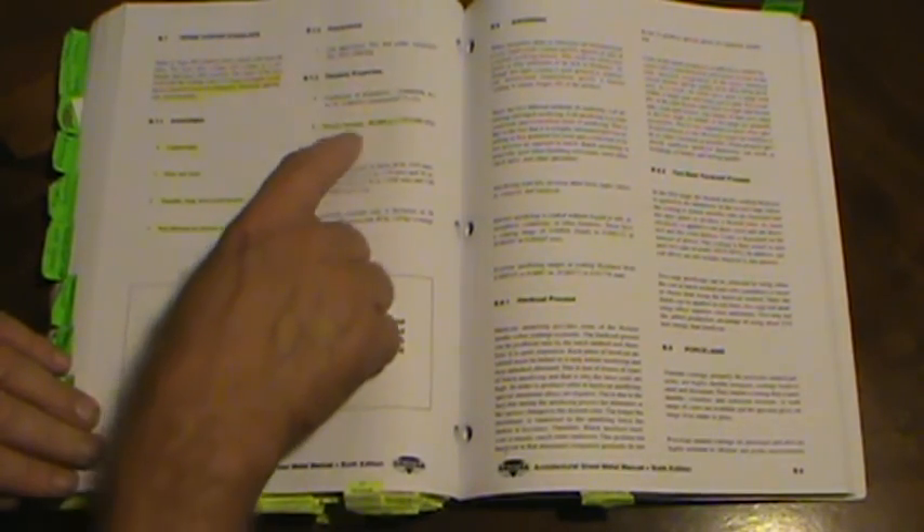Appendix B covers aluminum: it cannot be soldered — use rivets and sealer or weld the joints. Aluminum's tensile strength is 22,000 PSI. Stainless steel is highly resistant to corrosion in industrial, chemical, and marine environments; it is lightweight, doesn't stain, is durable, not affected by mortar or concrete, and has a tensile strength of 80,000 PSI — significantly stronger than aluminum.